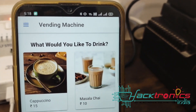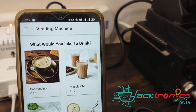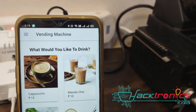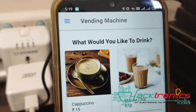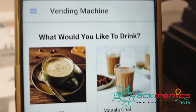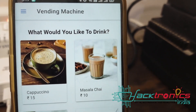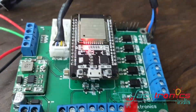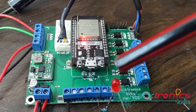All you need is an old mobile phone - even if the touch screen is broken you don't need the physical interface. The LCD should work normally; you can remove the touch screen or embed it inside a metal frame that hides the top bar and bottom buttons. This PCB is designed to be installed on a rail mount inside any machine.